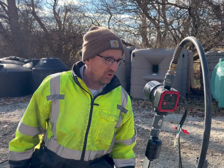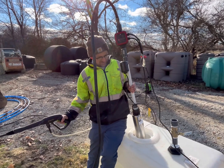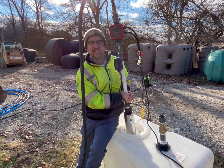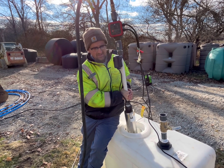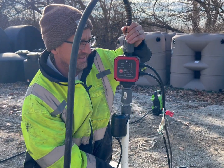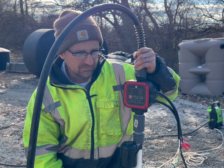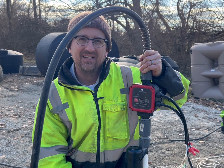To demonstrate this, I'm going to pull this pump out of the water. The system is pressurized — I'm going to relieve this pressure. Pump is on, running dry for a 10 count. I don't recommend doing this on a regular basis — you never want to really run your pump dry, but for demonstration purposes it's useful. So after 10 seconds it cuts off and goes into water shortage mode right there — that water shortage LED is illuminated. Once you get water back in your tank, you just hit this reset button and it's going to kick the pump on and re-pressurize the line and get you back up and running.